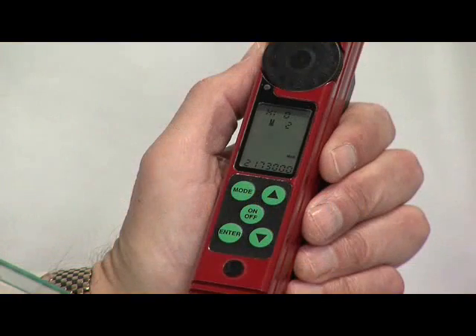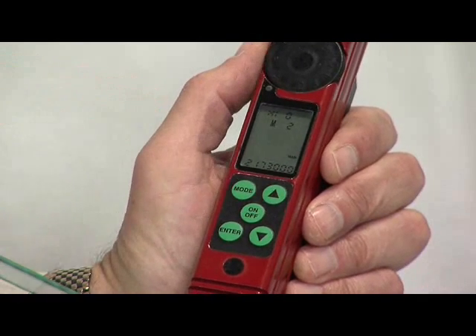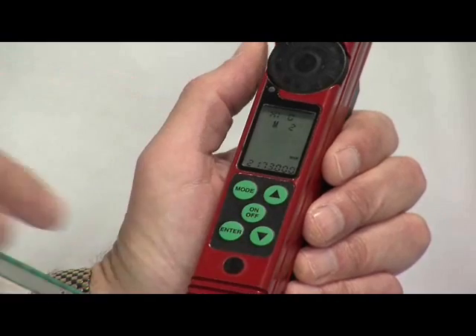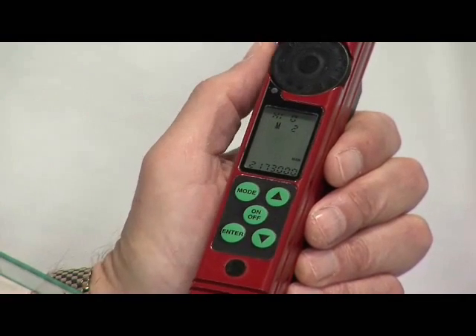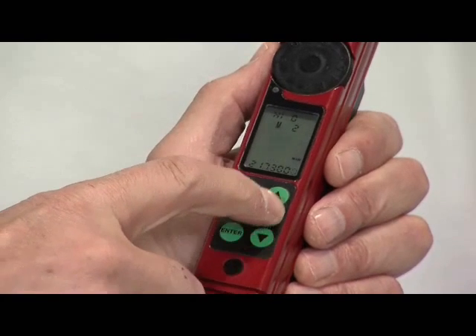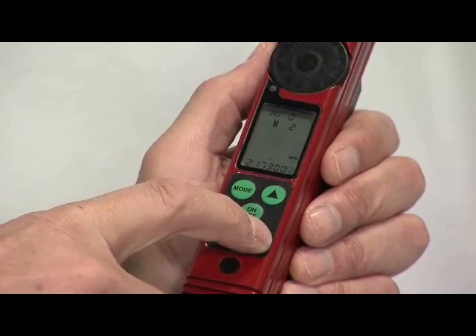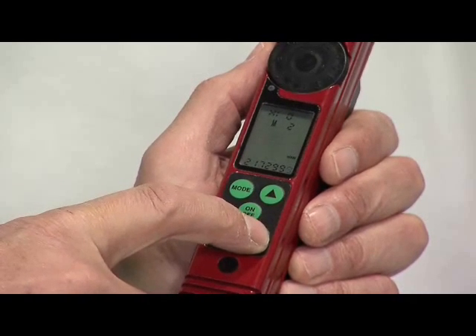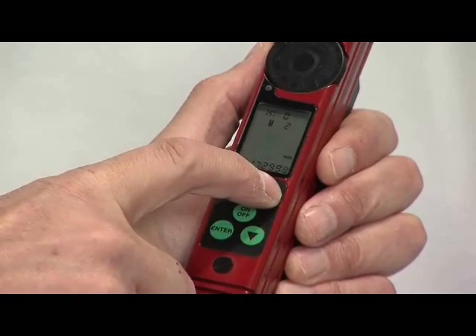Special to the Maxima Complete is the ability to fine tune the frequency. To begin, turn down the gain until you see one or two bars on the display. Hold the enter button down for one second, then use the up and down arrows to find the strongest signal or best sound. Press and hold enter again to complete fine tuning. You must complete the fine tuning process before you can move on to operating the receiver.